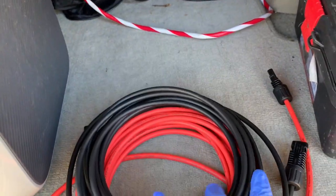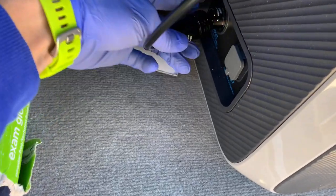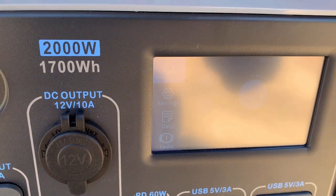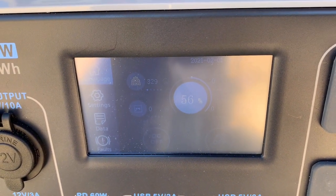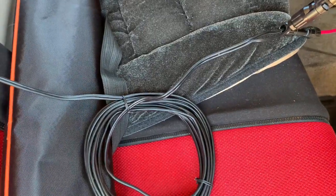I'm going to unplug this and connect two of these extension cables and see what kind of power I get this time. These are 12 gauge wires, a 20-foot one, so it's got quite a bit of length to add on. It takes a minute for solar to kick in — there it goes, it's at 328W. Not that much of a drop-off in comparison.